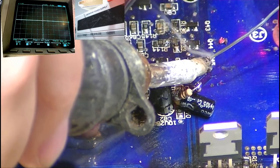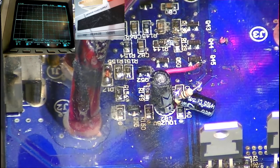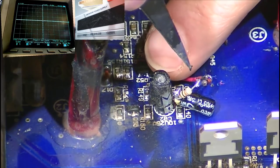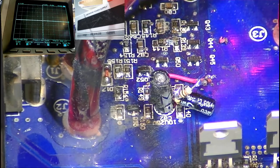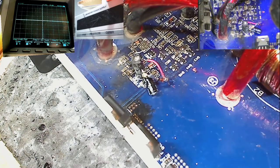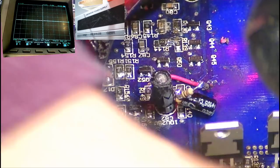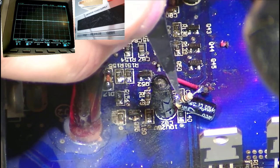And we're going to connect that to our diode, because that is the 5 volt supply to charge the capacitor. Our diode is just here, as you can see. There we go, lovely jubbly. So now this capacitor is going to charge up when the 5 volt is supplied to the TL494's pin 3. And then when the 5 volts disappears from the pin 3 supply, it's going to discharge to ground